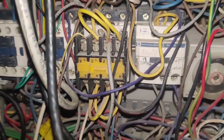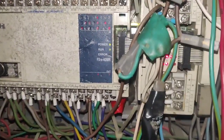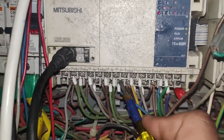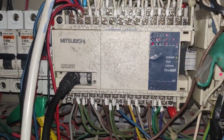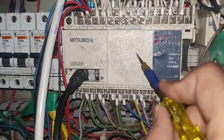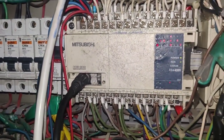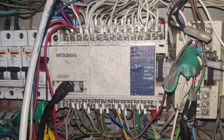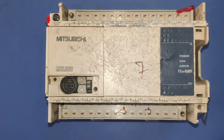If you have this type of problem, so you can repair easily. Y7 is blinking, Y7 terminal is here. First, you need to measure voltage here. If voltage is coming, then fault is in your wiring. But if voltage is not coming, that means PLC internal problem. First, we need to measure voltage in Y7 terminal.